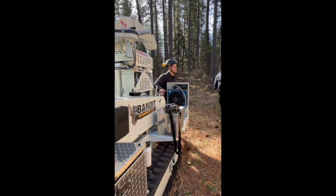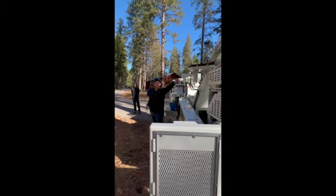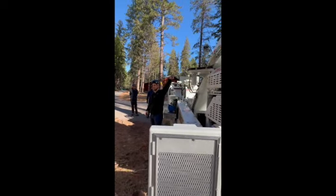Reason being, if you guys, again, clear plexiglass looking in, your drum is cutting the wood right here. It's now having to bring that wood up your discharge and then make a sharp 90-degree turn out. Right now, with the machine being brand new, we could do that. But as soon as something is out of adjustment, not getting that proper torque on it, it's going to sit right in that elbow right there and clog up and just be a pain in the butt. So keep it forward as often as possible.